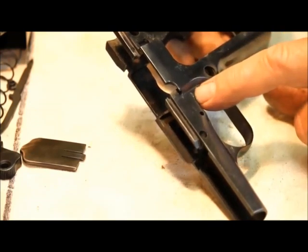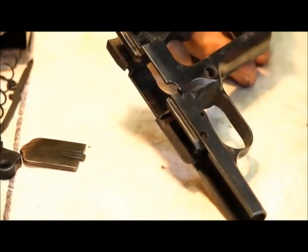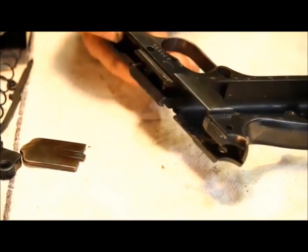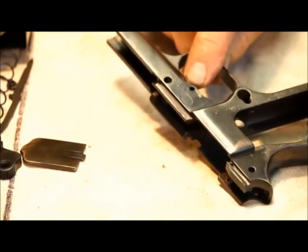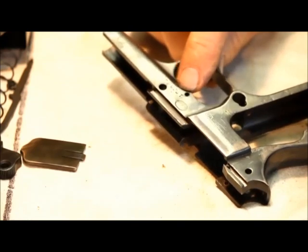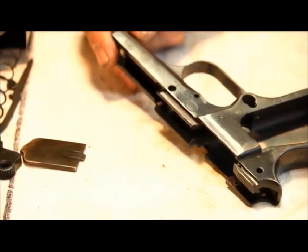These mean a lot to a collector. Now, we're going to save those, and what we can't save, if they've really been hacked on and washed and buffed, we will have our engraver hand engrave those back in place. The serial number is good and deep on this gun. If in our polishing the serial numbers get light, we will put them back in. This would be hand engraved in. We can do them on a pantograph or you can hand stamp them in some cases.